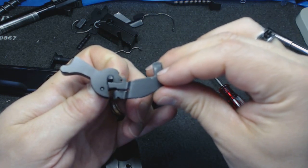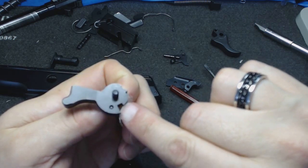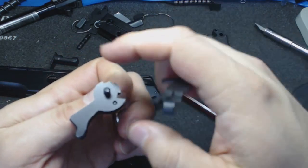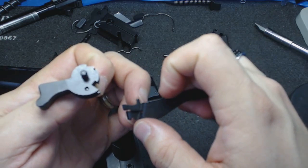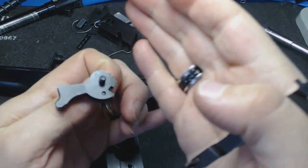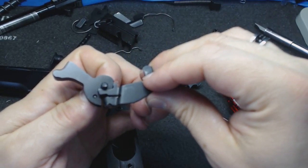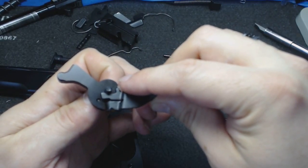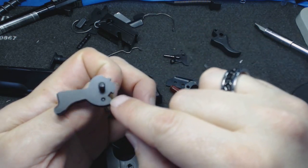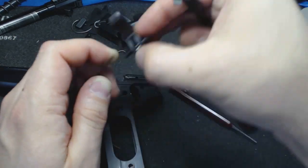So right there, it's underneath it, which means it's not holding on to it. So I've pulled the hammer all the way back, and then suddenly it's not holding on to it at all, and the hammer can come forward. Timing wise, it's designed to happen at the same time as this same mechanism for the single action has moved the sear system and the firing pin safety off of the hammer. So basically the double action is going to hit that point and actually engage the single action first, just slightly before the double action lets go. That way when the double action lets go, it doesn't just drop onto the single action. The single action's already been cleared and it just fires.